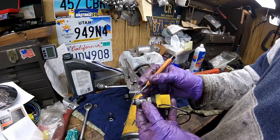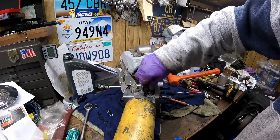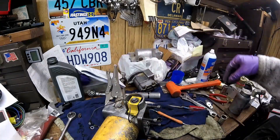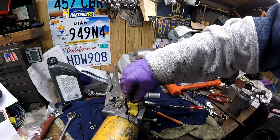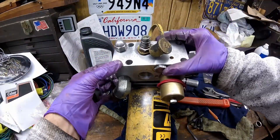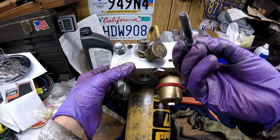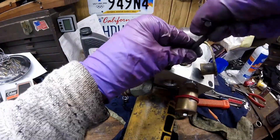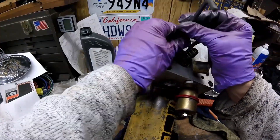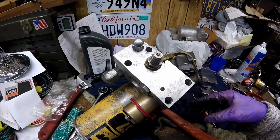This is the A-valve — it gets a backup and then an O-ring, and it also has an O-ring here. The A-solenoid goes in here, and a little never-seize on the stud, then the coil, and then the nut. When you're installing the solenoid section, there are three O-rings that go in here. It's important on these bolts to never-seize the thread, plus make sure that you never-seize underneath the head as well.